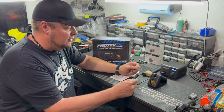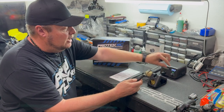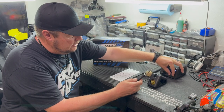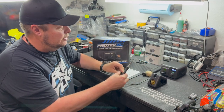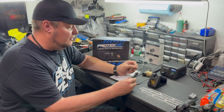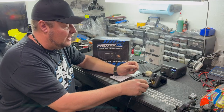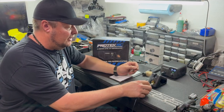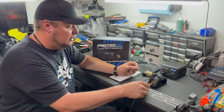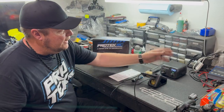At 302 degrees it's not going to melt the solder. As soon as I turn the dial up — we're going to start by turning it up to 930 degrees — you can see it instantly gets hot enough to melt solder pretty much instantly. I'll go ahead and clean the tip off.